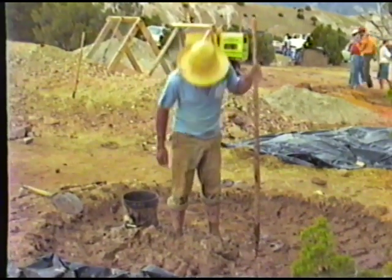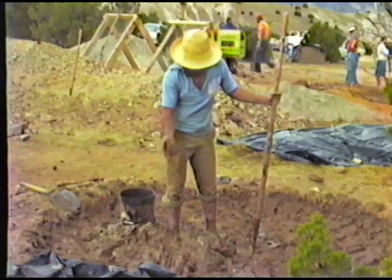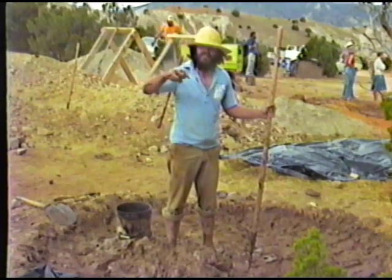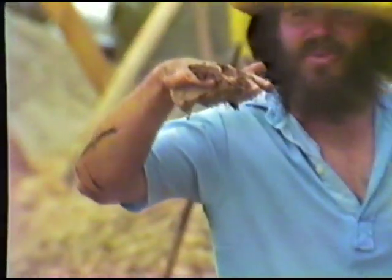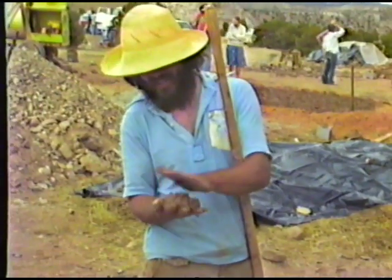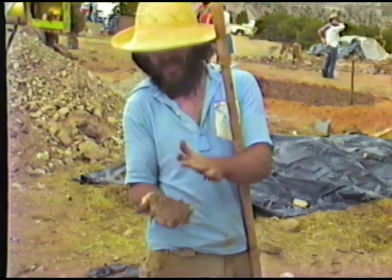What kind of mud do they want now? The main thing is that it's good and sticky, and yet it'll spread very easily. So it won't fall off your hand, is the test? One of them, yeah. Another one would be to spread this out and let it dry during the night, and see if it cracks.